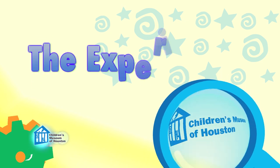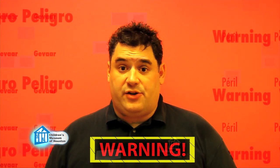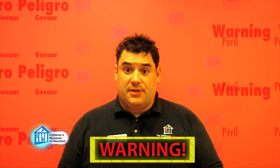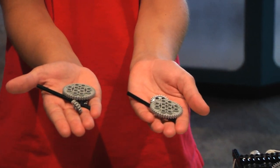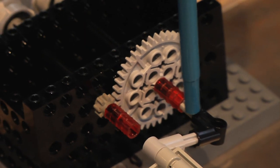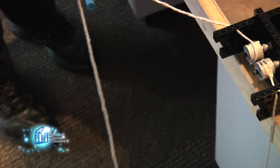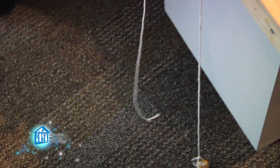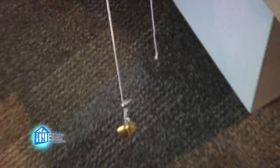Let me show it to you a different way. Before we begin, remember, science is fun, but it can also be dangerous, so always have a responsible adult helping you. We're going to be testing gear trains that gear up and down. We're using Lego gears, but you can also buy gears at hobby shops, hardware stores, or on the internet. We've built a housing to hold the gears. The gears can be switched out pretty easily with just some minor changes to the axle position. The two strings hanging down allow us to visually see how fast each axle turns, while the weight at each end of the follower allows us to feel how much effort is needed with each type of gear.